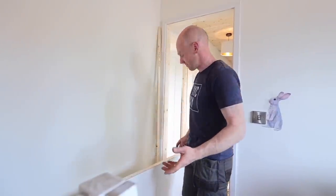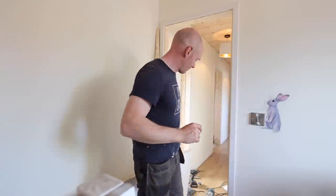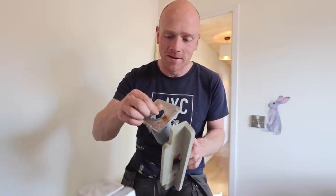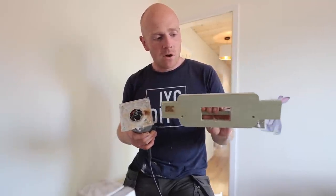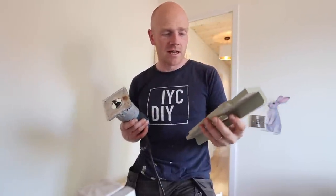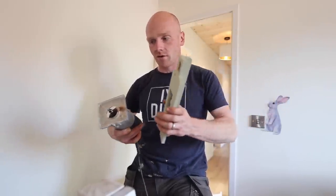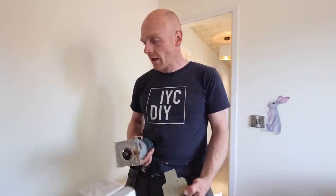I said that I hate doing doors — I do. However, it does get a lot easier once you've got a jig. Robin has sent me a bunch of goodies. Back at Christmas, we all met up for a Christmas meal in London, and Robin handed me a bit — this is a template bit. I knew that at some point I was going to try the jig. I've got both sized jigs — one is 76mm and the other one is the 100mm or slightly bigger one. They should fit 99% of your hinges in your house. This one is a lot easier than a huge great long skeleton jig that you've got to strap on the whole door — this is just literally per hinge. You hold it in place or clamp it in place and it's super easy.